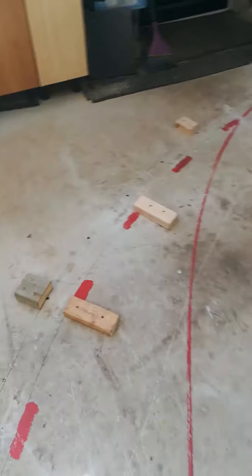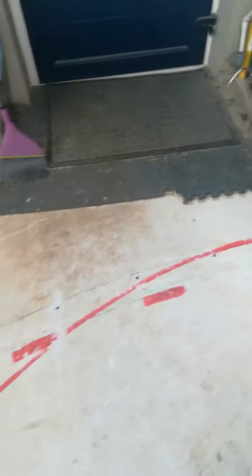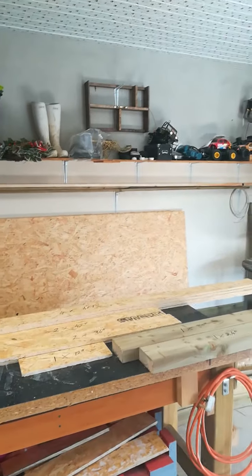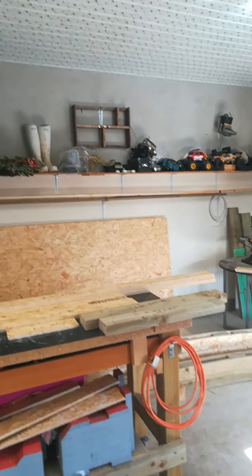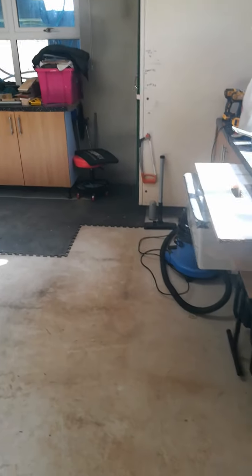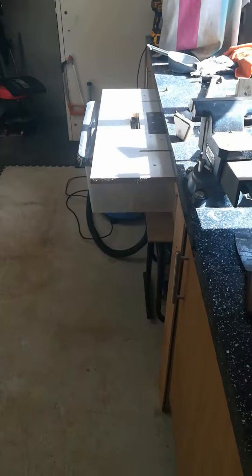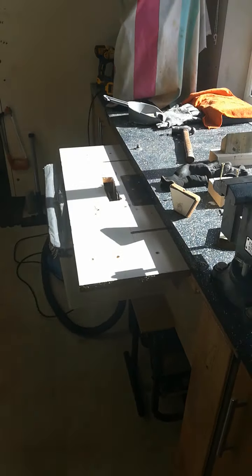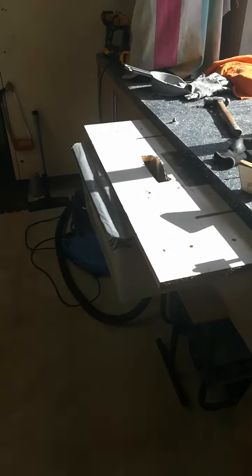And we've been doing this on the floor — we have our jig set up on the floor, bent around, gluing and screwing the OSB. As you can see in the back there, we have 8x4 sheets. We've been cutting that up; we're getting 11 strips of 4 inch out of that, ripping them up on this little saw table we have set up. This is just a little circular saw bolted in below — it comes up and down, and the little drawer slides in and out. We have a dust catcher below it, and the vacuum plugs on to the side.